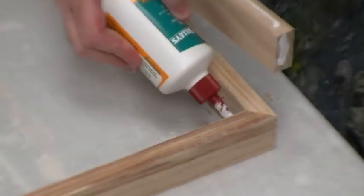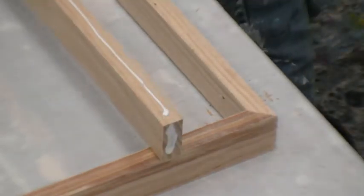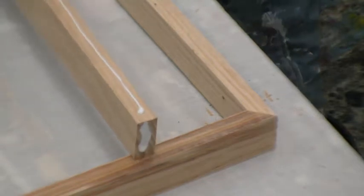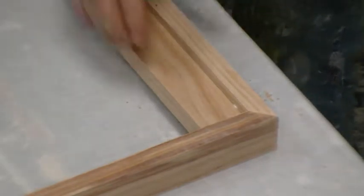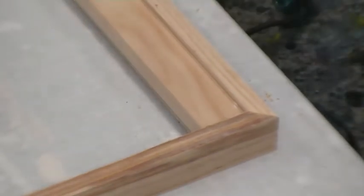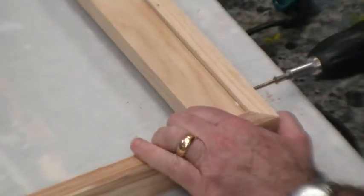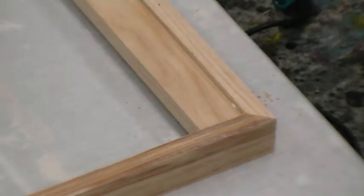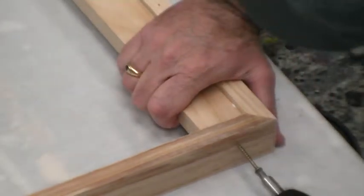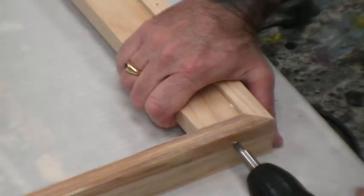Put a little bit of glue on the end and just inside where it's going to meet up, and do the same at the other end. We then put the timber in its right position making sure it's in at both ends — dropped down about seven millimeters from the top edge of the main frame. Then we put our screw straight through and hold it in position. We then put another screw in the other end, and this is where your right angle is very important, because screwing it in pulls the timber together at a right angle and squares the frame for you.